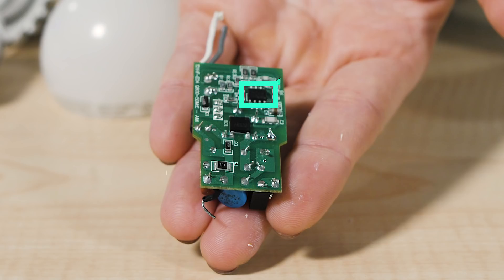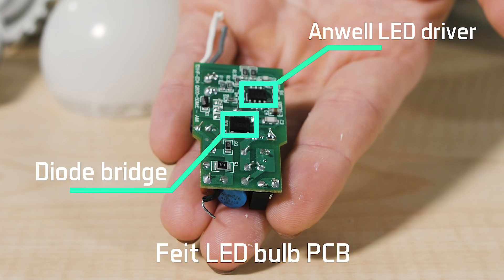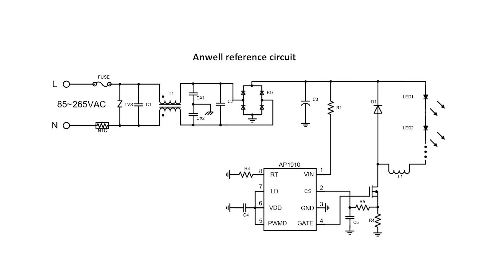There are also big differences in the circuitry itself. The new bulb uses a chip from Anwell Semiconductor in Taiwan. Not many details are available about this device other than that it's an open-loop peak current controller. The FITE bulb is dimmable, and it looks like the Anwell chip is using a filtered version of the dimmer waveform to set the dimming level, because there's no sign of a PWM circuit for dimming. A final point is that the FITE bulb uses a separate power FET to control the LED's current, suggesting the Anwell chip doesn't incorporate one.